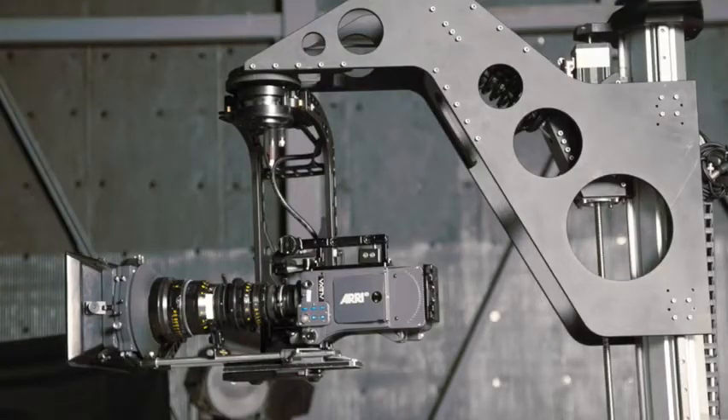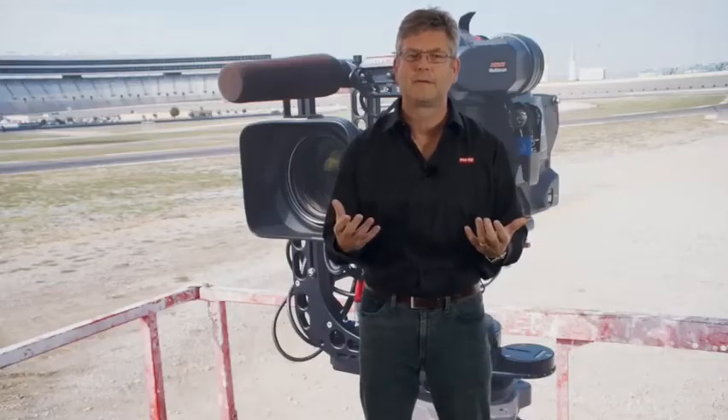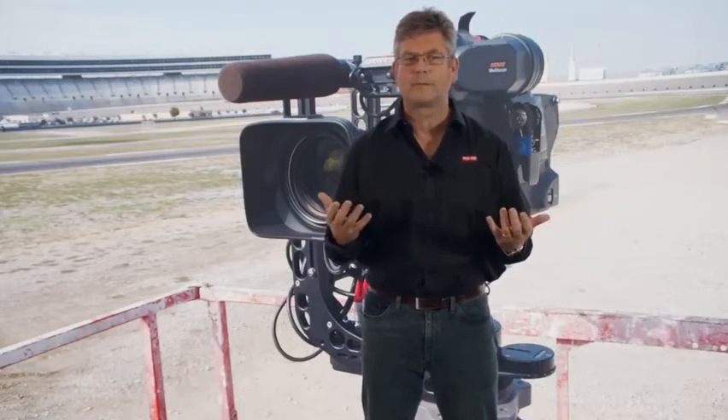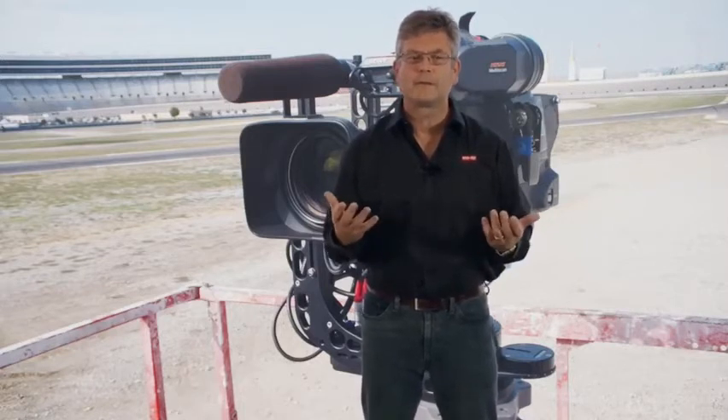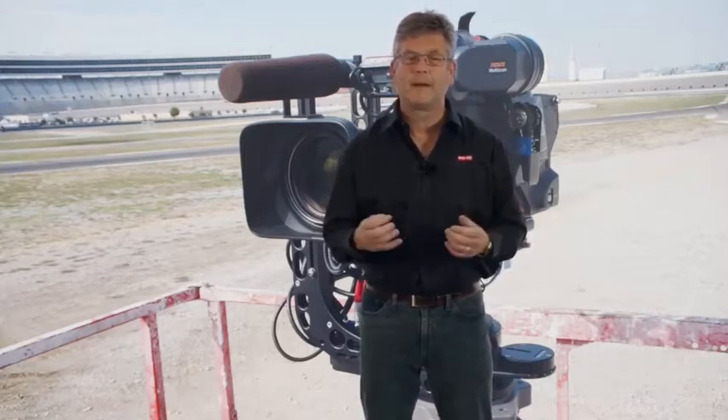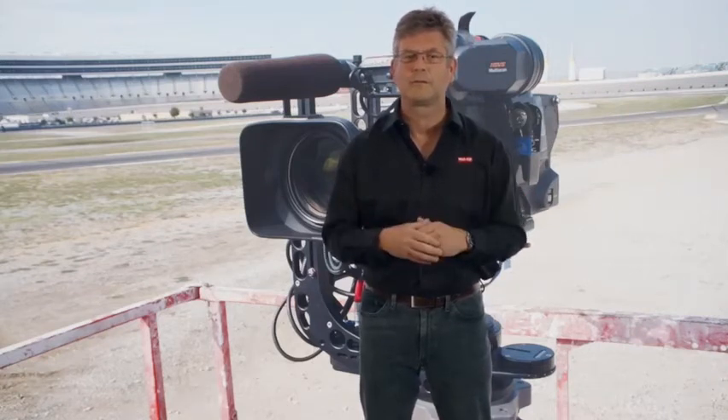It's incredibly powerful — you can hold a camera even unbalanced when lenses are being changed. It uses cycloidal gears, not worm gears, which are typical. Cycloidal gears are not affected by changes in temperature, no adjustments are required depending on the payload, and it doesn't produce any juddering under heavy load. So it's a really good choice of gear.